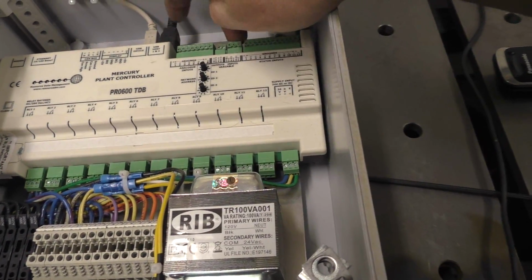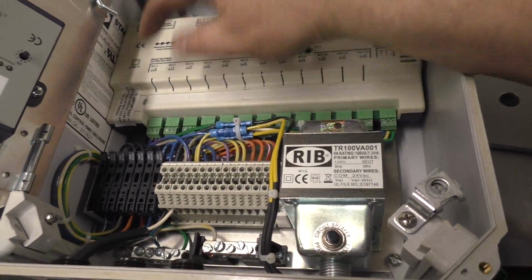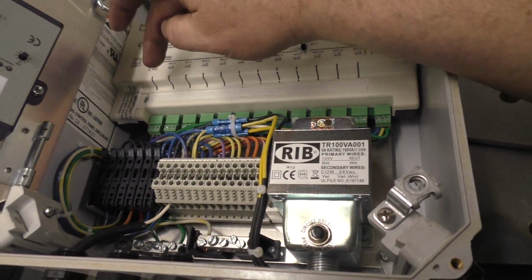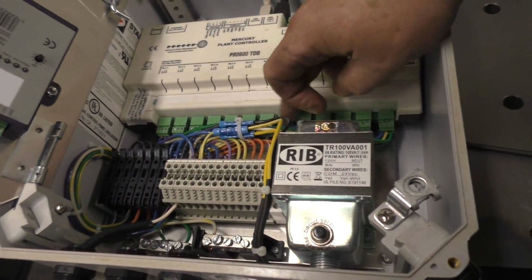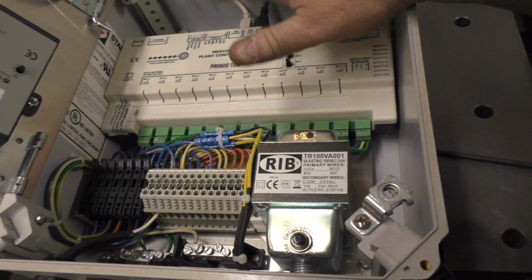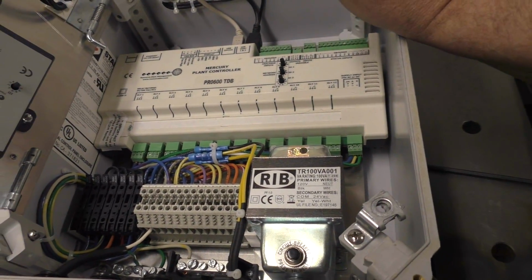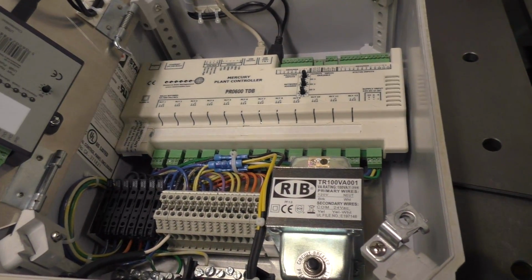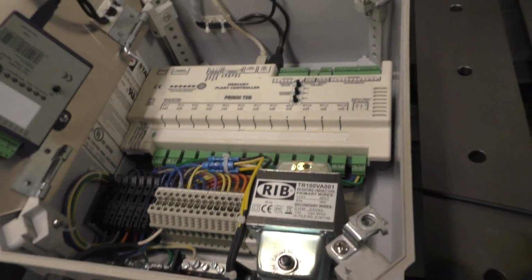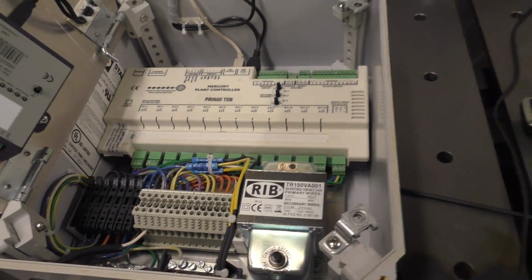Anyways, yeah. So I'm going to be the lazy man this summer. I'm hooking up my pool pump. I've got 12. So first one's pool pump, my solar heater will be the second one. I've opted those to be 110 and these ones to be 24 volts. These are going to be for some low voltage lighting. I got my sensors. I've got these really cool valves I'm going to show you. What you do is you energize them with 110. Capacitor charges. You take the power off the valve, and the capacitor swings the motor back to the closed position. I'm going to use the closed position for one reason: anti-siphoning on my solar heater, because it's up on the roof there, so it stops all the water from coming back down. And then I got a bunch of valves that'll modulate that if the pool water is satisfied.